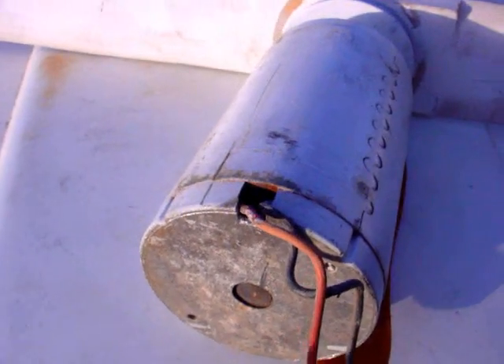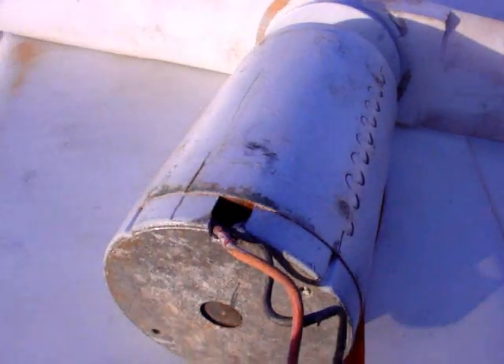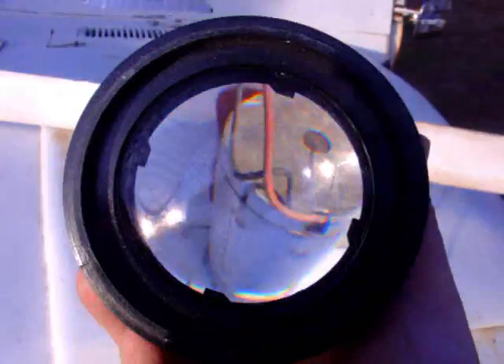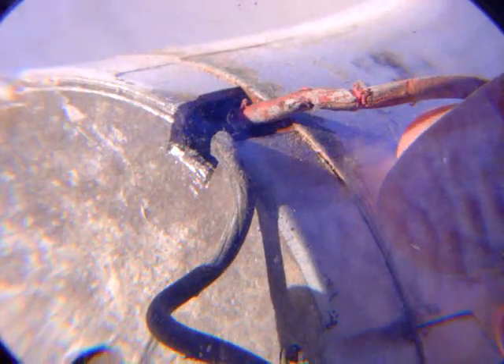Okay, maybe we can do this before the traffic comes. Brought it out here in the light. I'll show you one of my old tricks — remember this? This comes out of one of those projector-screen TVs, the ones with the Fresnel lenses that people keep throwing out. You can either do it like this or put it right up to the camera, come down and let it focus in, get a nice closer look at the wire. This little point where you see the crease — that's where the red wire shorted out to the ground.